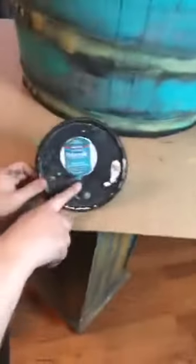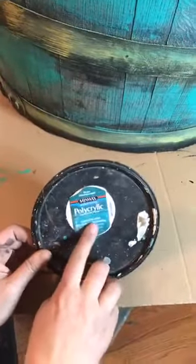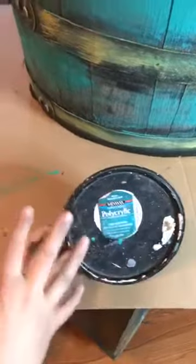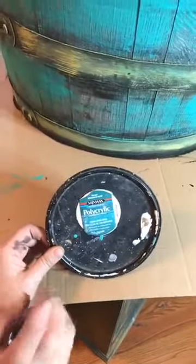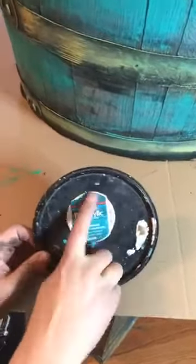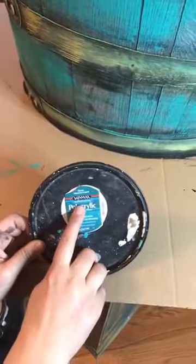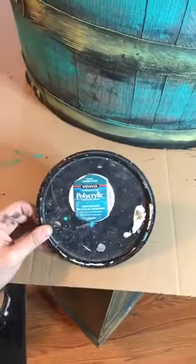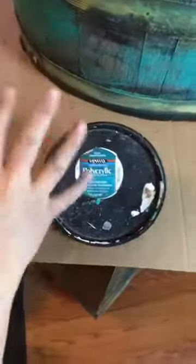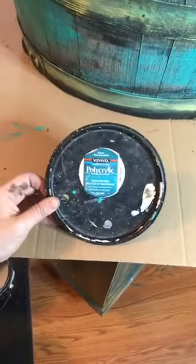Come take a look real fast, okay? So this is Minwax polyacrylic. This is the water-based stuff. I'm going to throw some on here because this is what I have in front of me right now. Honestly, like I showed you outside, I didn't even seal what I have outside. I'm going to use this to show you that you can seal it. But if I had to pick, I have Minwax that comes in oil-based as well, in a silver and gold can. That's what you want to use, okay? But for a piece like this that's rough and has a lot of hungry, thirsty wood, we're going to throw this onto it for right now. But I want to show you a quick technique that you can use to preserve and keep your color, right? Because we want to make sure that Matt's project stays good for a long time.